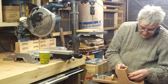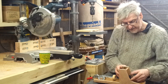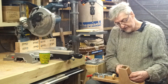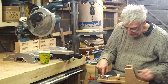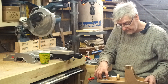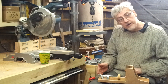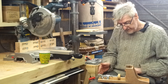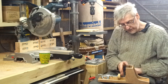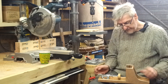The height is adjustable, just like on the Kreg K4 jig, to accommodate different thicknesses of wood from half inch upwards. I put six holes in here rather than just four to secure this clamp, which gives me more capacity than the Kreg. That allows me to move it forward and shorten it down to work closer to the work, or set it further back to accommodate bigger work.